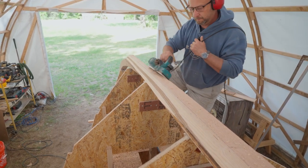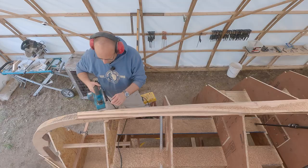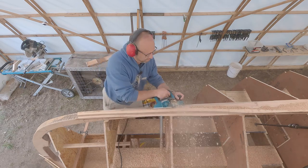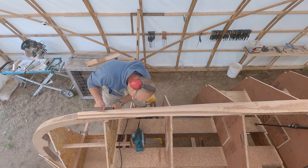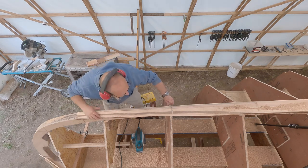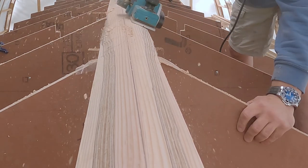Now that the starboard side of the keel is roughly to its final shape, I can move over to the port side and try to get it to approximately the same level of completeness. At this stage, what I'm doing is I'm comparing the pencil line that I drew down the center of the keel earlier, and I'm looking at how much meat is really left on the keel, and it should be roughly symmetrical on both sides of the pencil line, with the end goal, of course, being that once the keel is in its final shape, that the point that's formed meets right at the pencil line.